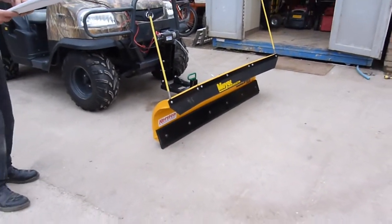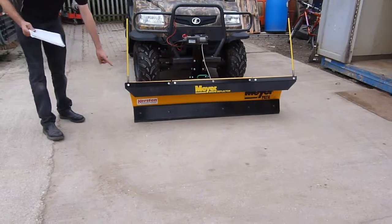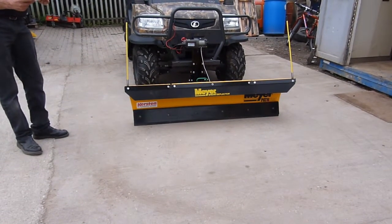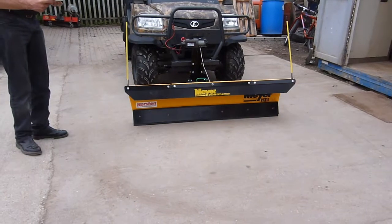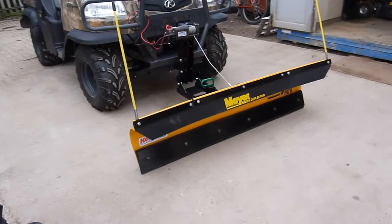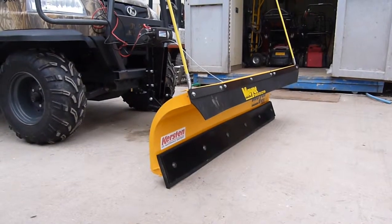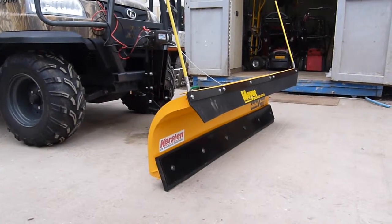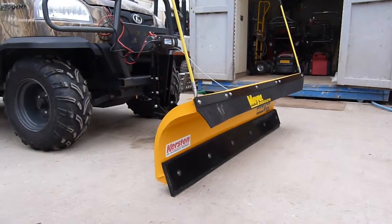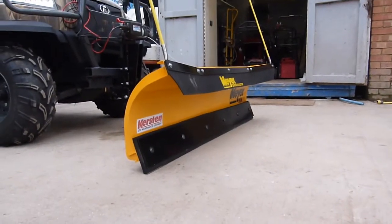The curved design allows the snow to roll up the blade and move forwards. The curved design of the blade is made by rolling the steel. Some manufacturers don't have the necessary tooling to produce this feature, so they put five or six bends in the steel, which causes the snow to stick to the plough. Only Meyer uses an electrostatically charged paint system with a Teflon content to provide a non-stick surface to the plough, which again encourages the snow to exit the plough surface quickly, reducing the traction requirement of the vehicle.